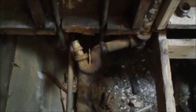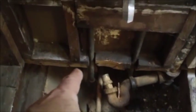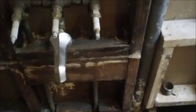I need to keep it a little open because I need to keep some space to work on the plumbing here. I need to change out this galvanized down here. I want to put PEX in up here. PEX is the really good poly tubing. It's outstanding for plumbing jobs, and it's really what's mainly used these days because of the price of copper, and I've been very happy with PEX over the years.